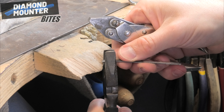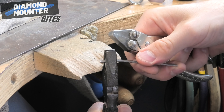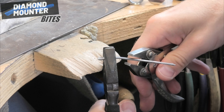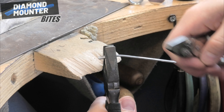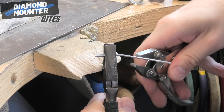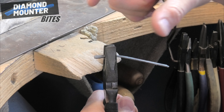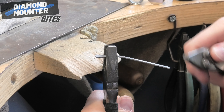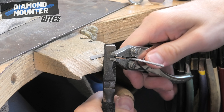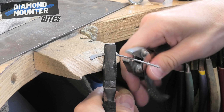I'm not trying to do the full bend at each go. I'm just tweaking it a little bit, moving it along — it's quite small. Try to move it the same amount every time and tweak it the same distance every time; it never works perfectly but it does help you end up with an even curve. That's what you want — if you end up with a curve that's sharp, then straight, sharp, then straight, all that has to be ironed out before you can form it into a collet.